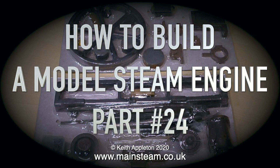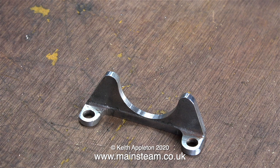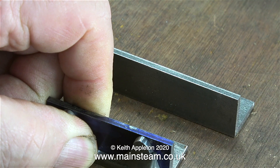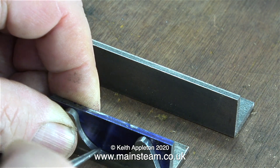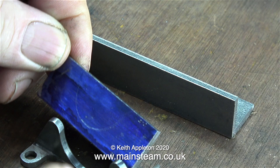All of the edited clips you're about to see are taken from part 24 of the series. In the previous episode I wanted to show the simplest method of making one of these brackets: drill a lot of holes, break out the center, and file it to size, then use a small drum sander to get a good finish on the inside radius. On this first bracket everything was going well until right at the end — I rounded a part I shouldn't have: the outside edges of the mounting lugs. I couldn't live with this, so I'm scrapping that part and making another one. I've coated the new piece of steel angle with marking-out blue.